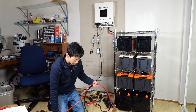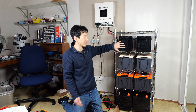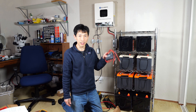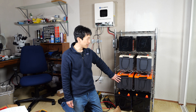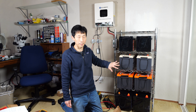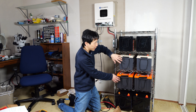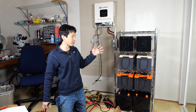I have 20 feet of each color to cut to size so I can connect these together. It's okay to connect them in parallel — the manufacturer says most of them don't recommend connecting different manufacturer batteries in series, so I have to be super careful. I'm using a battery balancer to make sure it stays balanced. This one is 120 amps max; the other three, including the LI Time, are 200 amps capable with a 200 amp BMS. With my 5 kilowatt, 48 volt inverter, it only needs about 100 amps, so it definitely doesn't need the full 200 amp capability.